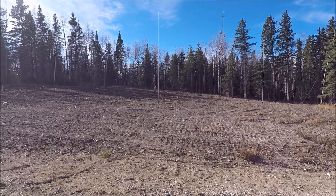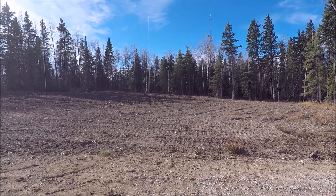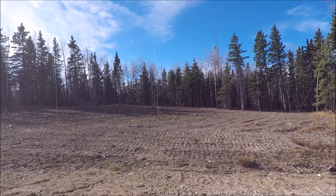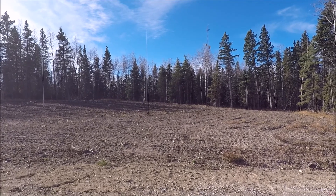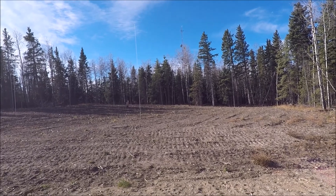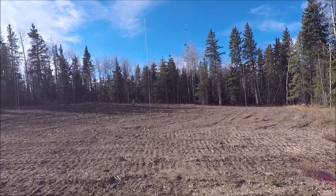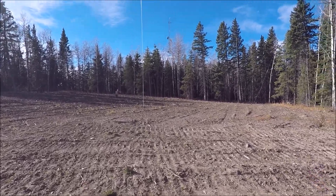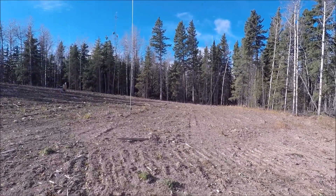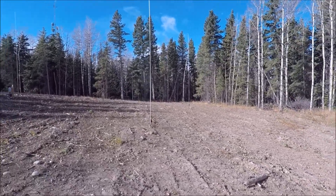In the center is the phasing box. This array was purchased from DX Engineering, and it's the YCC Club — the Yankee Clipper Contest Club — that designed and built the box and made it available. Very affordable and a fabulous array; so far extremely happy with it. The feed line has been trenched out to the center box. The verticals themselves I built just from aluminum tubing, approximately 25 feet high.